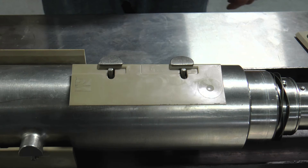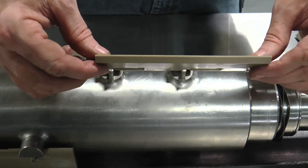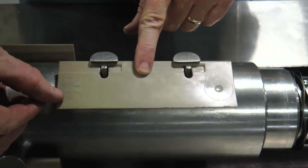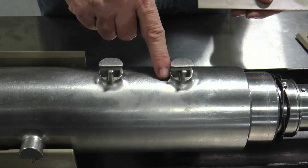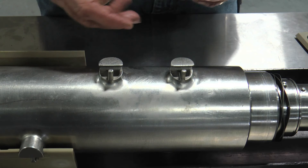The scraper blades are removed by lifting up and pulling them from the pins. Plastic blades with the locking feature should be lifted upward and then slid to the right before removing them from the blade pin. Reverse this procedure for reinstallation and make sure the beveled edge is installed toward the shaft. The blade pin holders should be inspected for unusual wear on the pin tops and slots. Blade pin slots should be round and uniform in shape, indicating the blades are free to float and move through each revolution of the shaft.